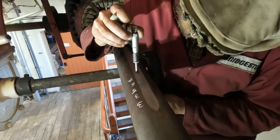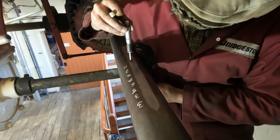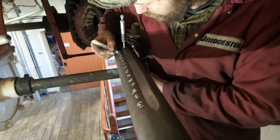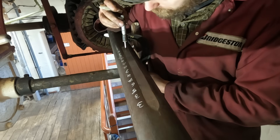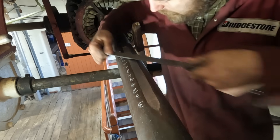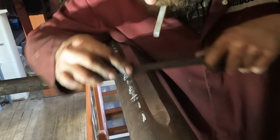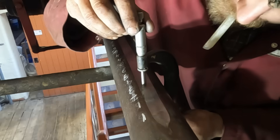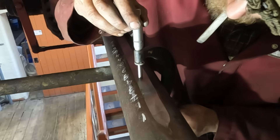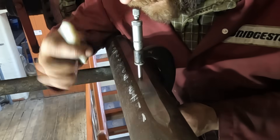This is a flat saddle key, so it only sits on a flat on the shaft as opposed to being in a keyway. These keys seem to have been quite common on shafting — I have plenty of old bits with such flats clearly hand filed or chiseled on. Where the high numbers are is where the high spots are, so I continue to work those down with the file until the numbers are within a few thou of each other. Flatness is not as critical on the far end of the key seat where it will be outside the hub, so I pay less attention to that area as long as it's close.